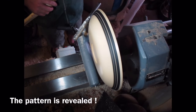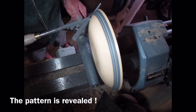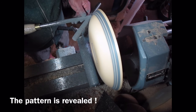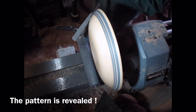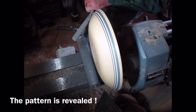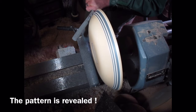I've put the bowl back onto the lathe now, still using the faceplate. I'm doing a bit of shear scraping using the lower wing of the bowl gouge just to cut the Milliput back, and as you do this the pattern gradually appears. I'm doing it very gently — I want to just cut the Milliput back until it reaches the wood; I don't want to really reshape the bowl at all. The pattern becomes more and more well defined. I'm just turning it off occasionally just to check, and just doing a little bit more. You can see the lines are very well defined now.